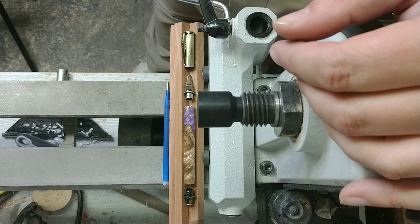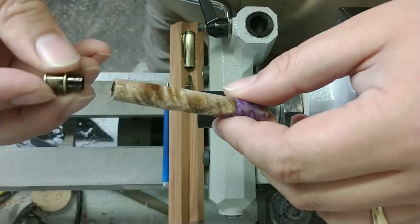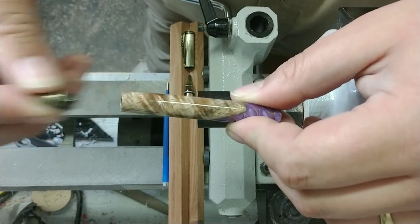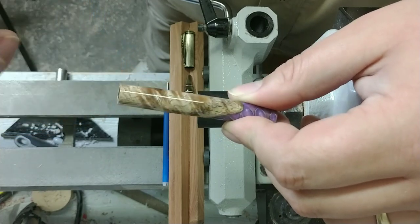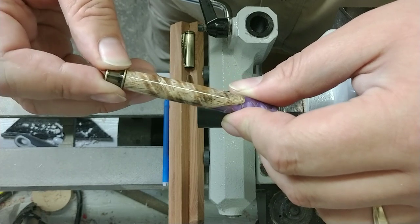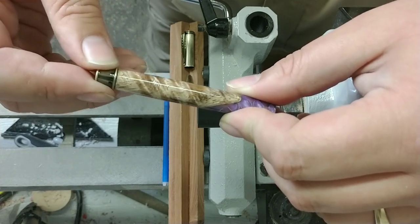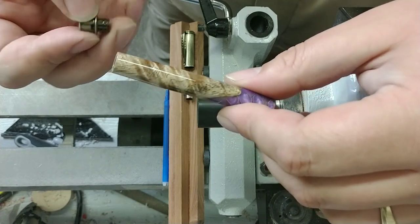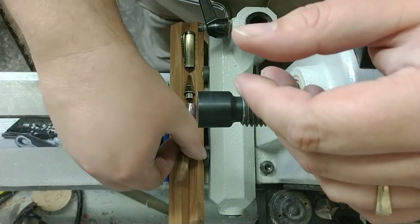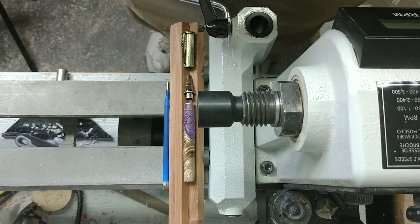What we're going to do is we have to glue in our front and back pieces, same as if we were doing a G2 ink style pen, because these just push in and out. The 8mm tubes are just slightly wider because they've got a slightly thinner wall than the standard 8mm that the editors come with. And so you're able to push those in and out. Just put a little glue on the inside of the tube, and then press that in. Which we will do that now.